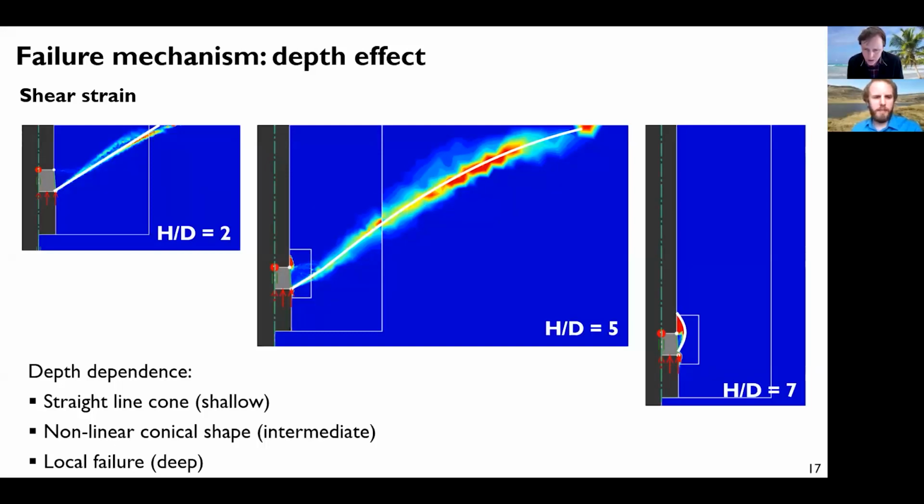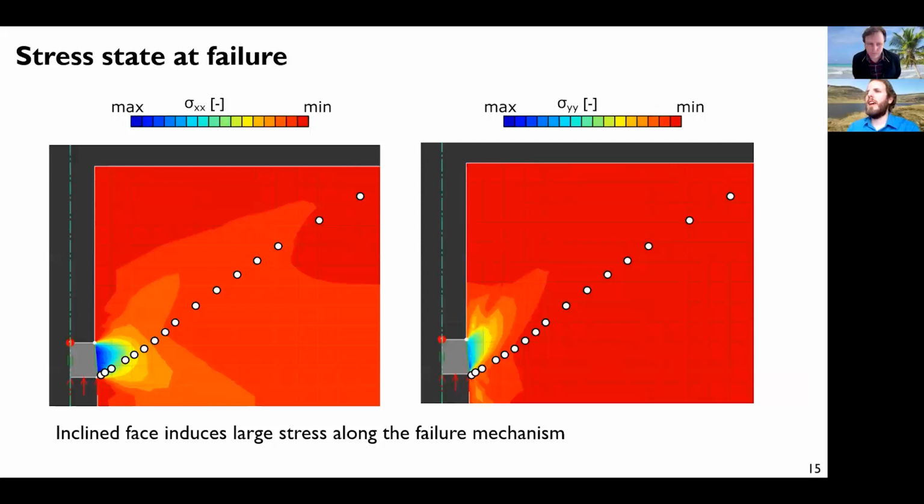Yeah. So then there's a question that all these designs are based on the Hoek-Brown criterion, right? Yeah. And another question is the bonding agent between the rock and the anchor. If it's not grout, what is it? I guess it's pure friction. Yeah, but it's the whole point of this anchor, so we can see it properly here. What makes the anchor an anchor is that it is expanded laterally.